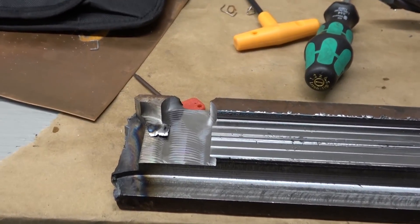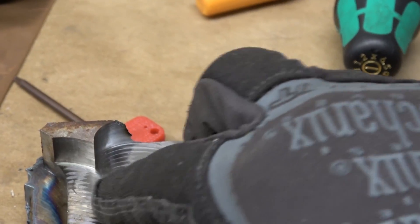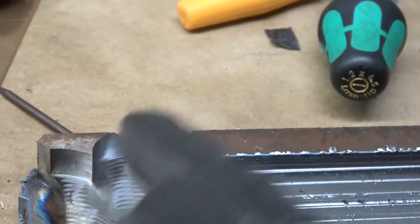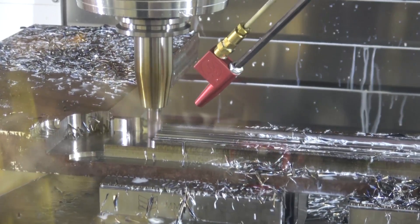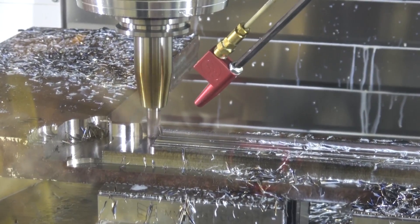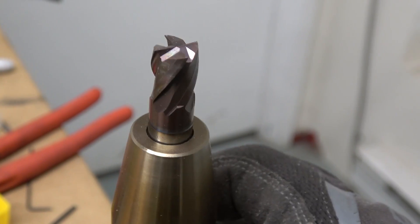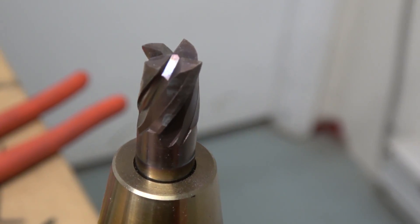If the last part of that cut didn't wake you up, then the baying neighborhood dogs ought to have. We can see that the geometry is critical as well — it was getting into not so much a trochoidal cut, but where it was getting squeezed, cutting in a corner. You heard the results. Not only do you get the recipe right, but you get the tool paths right. And this reputable hard milling tool — she's right cooked. It just cannot handle vibration.